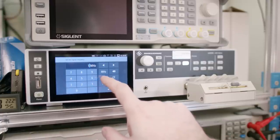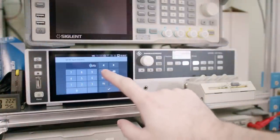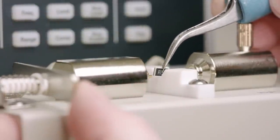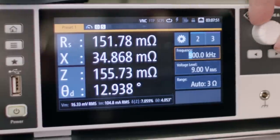As a comparison, let's take a quick look at a 10 ohm current sensor resistor. At low frequency it measures 10 ohms impedance; at 1 megahertz, 11 ohms. Here's a 150 milli-ohm surface mount current sensor resistor — this current sensor resistor is rock solid all the way to 1 megahertz. Three of these 150 milli-ohm 1 watt resistors in parallel equals one 50 milli-ohm 3 watt resistor, but these are usable at higher frequencies. This information is not in the datasheets, so you need an LCR meter to know the severe impact one option has over the other.